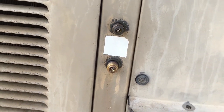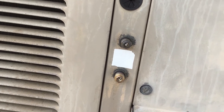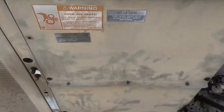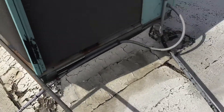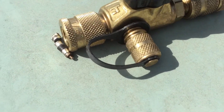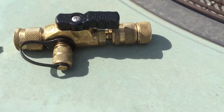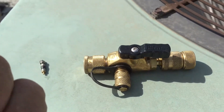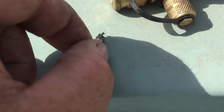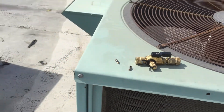My side is leaking badly. Normally I just put a brass cap on and cap them off because I won't attempt it with any other Schrader removal tool — I can't get it to work properly. But the Hilmor worked perfect. Pretty impressed. You see how bent that thing is? Very impressed.